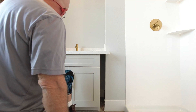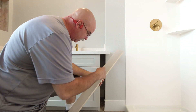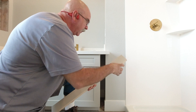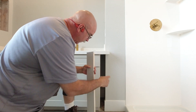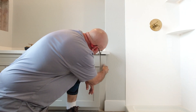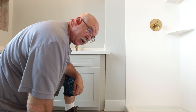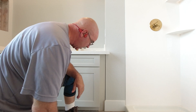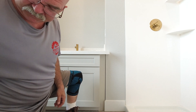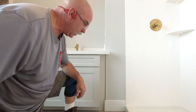There was a whole lot of discussion about how to solve it. Nobody really came up with a grand idea, and I said, well, let's just recess the filler back. I cut a filler that essentially fits the size we need here — it's got a little bit of a dirty stain on it, I'm going to fix that before I'm all done. I cut the filler to three and an eighth inch and all I'm going to do is slide that filler down in behind here. They brought me a filler that's about a quarter of an inch short, so evidently somebody cut it off, but we'll overcome that down here because this has to have tile. I've got a quarter of an inch of slop room down on the bottom.